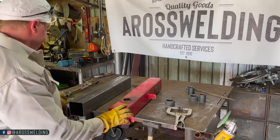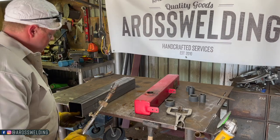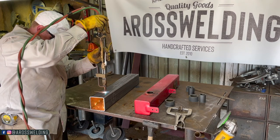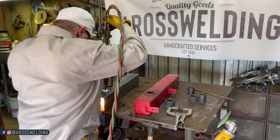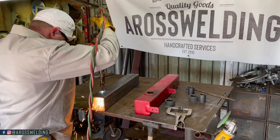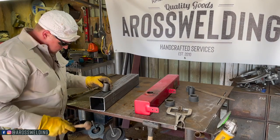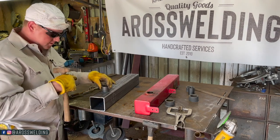Let's go ahead and fire this circle burner up. Start cutting. So I've got it set to my 1 inch holes right now, so we'll go ahead and cut all three of these and then adjust it to our 2 inch hole and cut them. Before I cut these other ones, I want to make sure my collar is going to be close to fitting. And that is perfect in my opinion. A little bit of gap is okay because we want to get some good penetration.